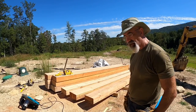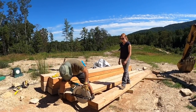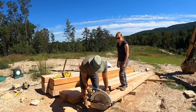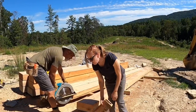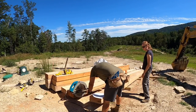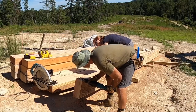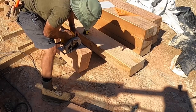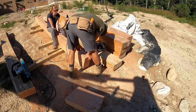Now I'm getting ready to make the cuts. I've got the template already used on this one and I've got the bird's mouth marked. Going to go ahead and cut it and get it ready. Should probably buy a new blade — definitely going to get a new blade. Let's go ahead and rip it up. It's a little shallow but I want it to be a little shallow — I didn't want it to be too deep.